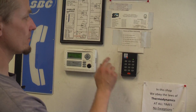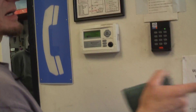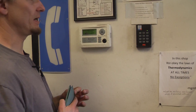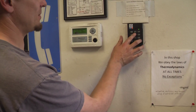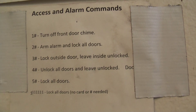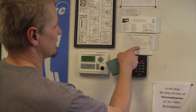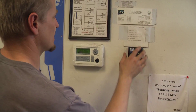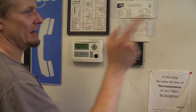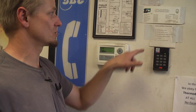Something else interesting - I can hit Command 4, and that means keep all the doors unlocked. So now both the front door and the middle door are going to be unlocked all the time until I change it again. If I hit 5-pound, it beeped five times to acknowledge, and that'll lock all the doors - front door and this one. I also have the ability to keep only one door unlocked, so I can leave this one always unlocked and just lock the back or front door. I can also program commands to turn the door chime on and off.